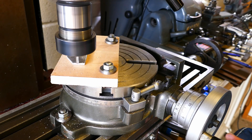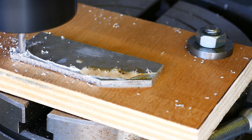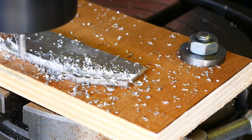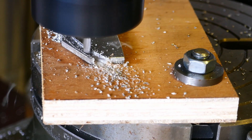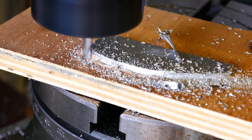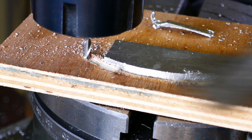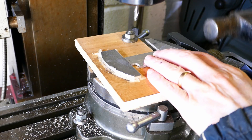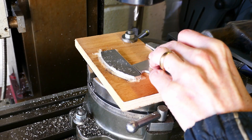For this example I wanted to prove the use of a plywood fixture and see whether the glue would hold, but I was surprised by how much force was needed to remove the workpiece after machining all edges. I used the hammer method and the clamping bolts shifted before the workpiece would let go.